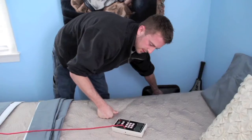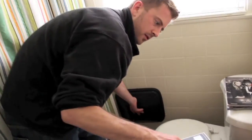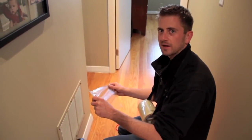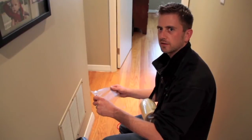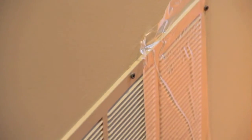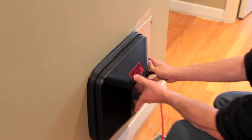We're going to go around the house and check all the supplies and returns. For this one, since it's a little bigger than the others and my pan won't exactly cover it, I need a newspaper or magazine or something to help cover that. What I have here is called duct mask — it's a perforated tape specifically used for sealing ductwork. Since the opening of the return here is bigger than the pressure pan, I need to cover and seal part of it to get the right number.